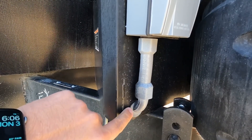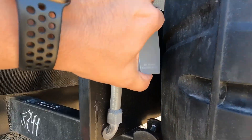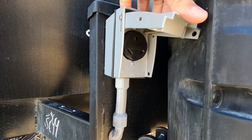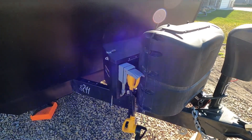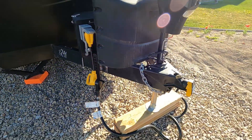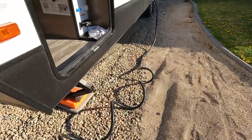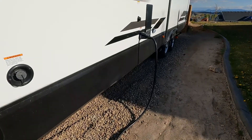Push the wire up through some conduit to the 30-amp receptacle. I would have hooked it up on the right-hand side, but I hooked it up on the left-hand side. Just hook it up like you're boondocking — like you're hooking up to regular shore power right into the RV.